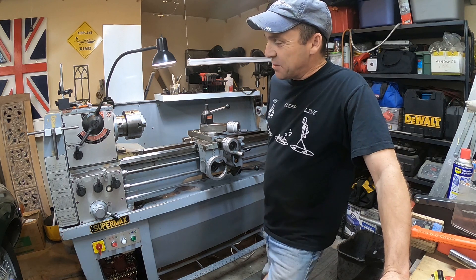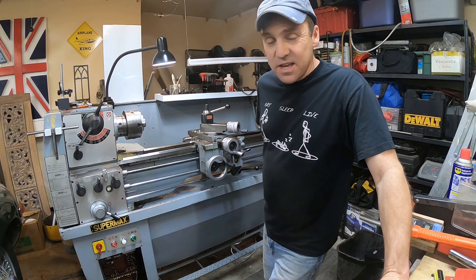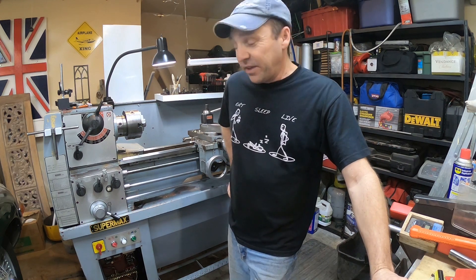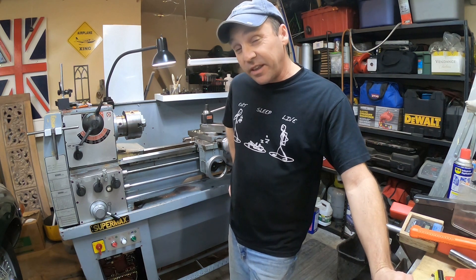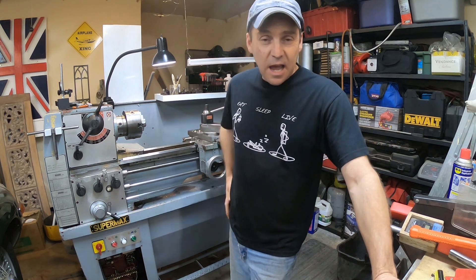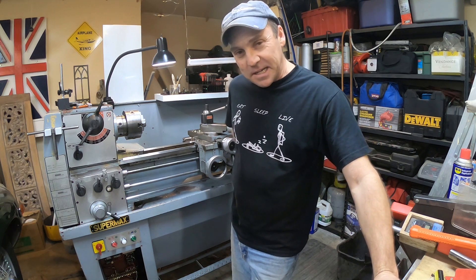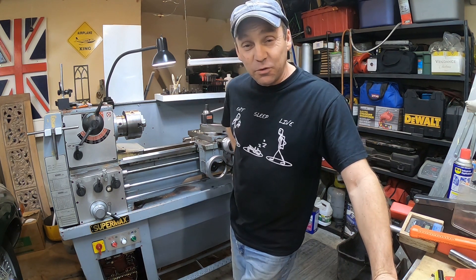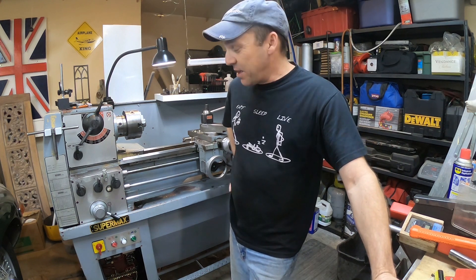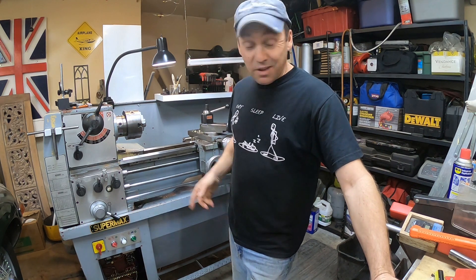Let's take a peek at the lathe. Something kind of interesting with this one: two-speed motor. Most of the time, if you're going to run a three-phase two-speed motor machine in your garage, you're going to find out real fast that you're up against a fence. What most guys usually do is take that two-speed motor, wire it on the high, and then play games with the VFD — dial down the frequency if they want to go slower. Not anymore. There is a gentleman up in Canada named Matt. I'll leave a link in the description to his YouTube channel. He is the VFD guru, and I'm doing this on an $80 VFD that came from China. In fact, it's the same VFD — I stole it off the mill while I'm waiting for a second one to arrive.